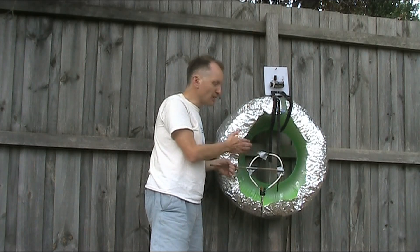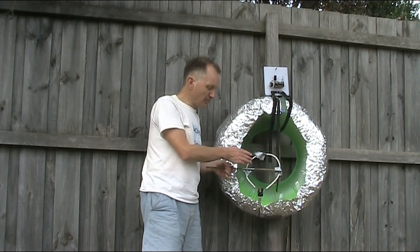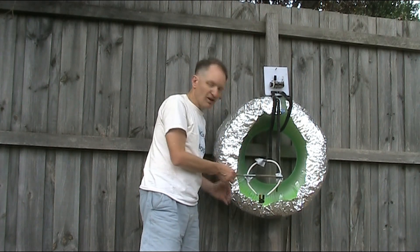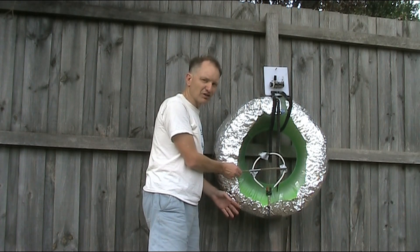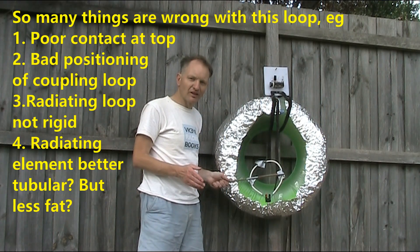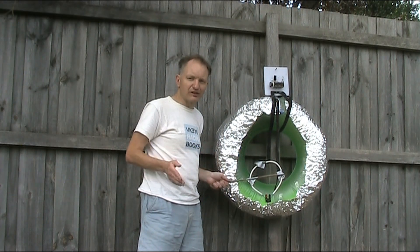Other things I could do: maybe if I had more foil and was able to make this a full proper ring rather than just relying on the outside — maybe that's going to be better. Maybe I could experiment more with the shape, size, orientation, or position of the loop that is coupling the RF from the transceiver. Maybe even another method of feeding it, like a Gamma Match type of arrangement. As you can hear, it's working as a receive antenna, but I'm not particularly happy with it as a transmit antenna. If you think something like this has potential, then let me know in the comments. Better still, build one yourself — maybe spend a bit more time than I have — and let's see if you can make some contacts with something like this. Please let me know how you go in the comments below.